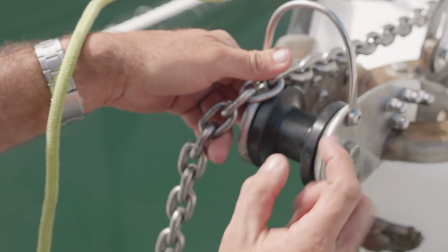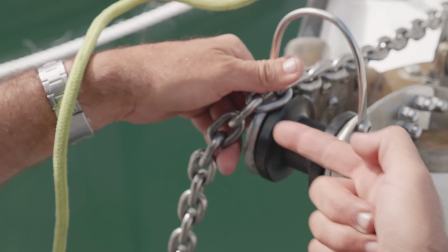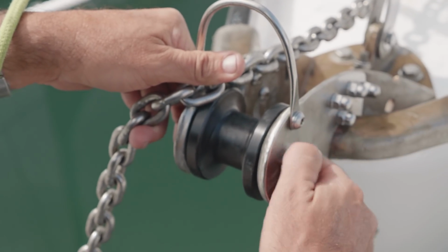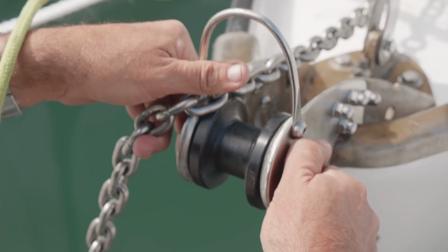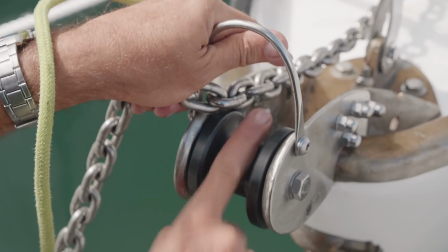So this presses down on a stainless steel bush that Pete turned up that fits exactly through the middle of this roller. What that means is, as I'm tightening up this 12mm bolt, and you can get a lot of force on that bolt, the force comes to bear directly on the bush, but then this roller is free to spin on the bush.